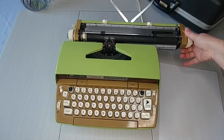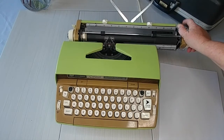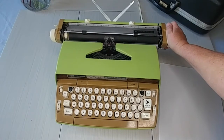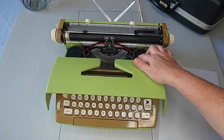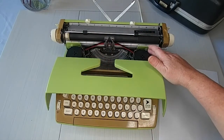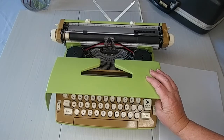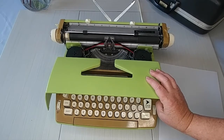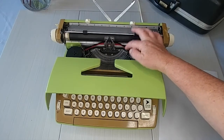Right here on the right side is also a carriage release lever — you can use your finger or your ring finger — that also releases the carriage. I'm going to pop open the top; you just gently pull it forward. Inside you're going to see a universal ribbon. It has a new ribbon — we install new ribbons on all of our typewriters. We also sell type ribbons at jotandtitletypewriters.com, and we'll even hand-wind your existing spools. When you change it out, make sure black is on top and red is on the bottom.